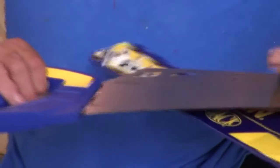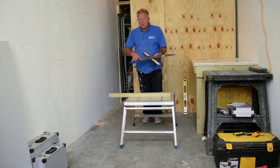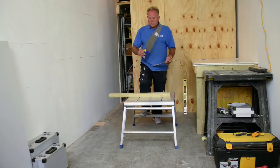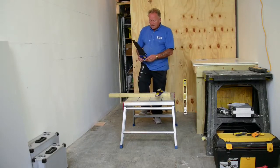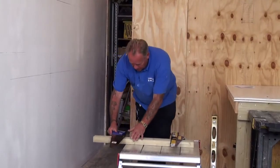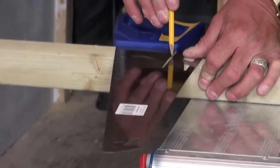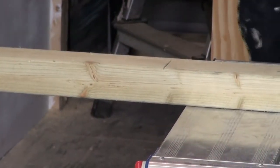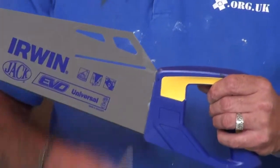The other thing that they've done — most saws have got a handle. The handle on most saws is not set square to the blade, or at least not all of it is. Some of the handle is set square to the blade, and then the top of the handle goes backwards at 45 degrees. That's a very quick way for a tradesman on a site to get a 90 degree angle. With this particular saw, you can see the blade has got a cut in it. So if I push the saw handle up against this piece of timber and then mark through this slot, I know that that line is at 90 degrees to the timber. Similarly, if I put the handle on the other way around, you can see that I've got a 45 degree angle there as well.